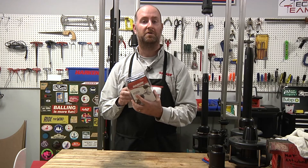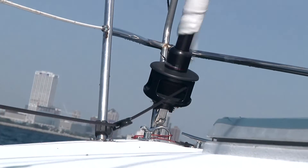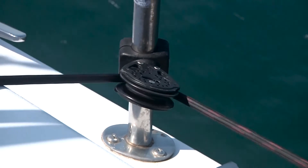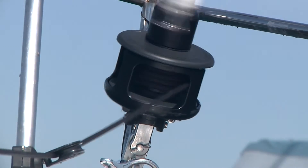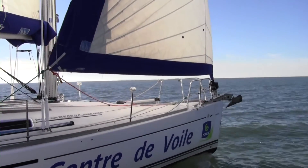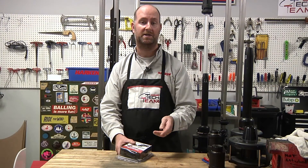Harken offers the 7404 lead block kit. This kit contains five blocks: the first being the most forward block up near the front, three outboard lead blocks, and the last being a ratchet block. The benefit of the ratchet block as the last block in the lead kit is to create tension on the line as it goes forward onto the drum, preventing any override on the drum. Both ESP and Mark IV furling can be wound clockwise or counterclockwise — just pay close attention to which side of the sail the sun cover is on, as it will determine the winding direction.